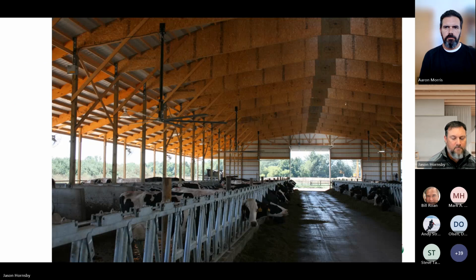So I'm going to jump right into why these fans were invented. Our owners were given a task by the University of California, Riverside to come up with a better solution to cool dairy cows other than the high-speed fans you see on the outer wall of this barn. So they invented the first HVLS fan. Of course, it's not the design that you see in this picture. From what I've heard, it had belts and pulleys, and they were just trying to build a big fan to see how it would work. Of course, over the years, we've come to a very efficient design.